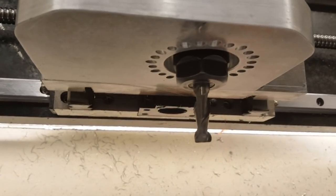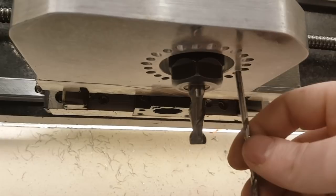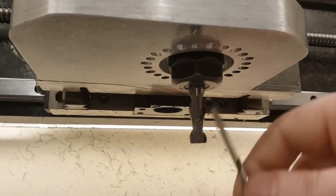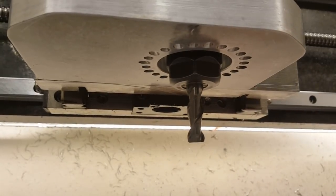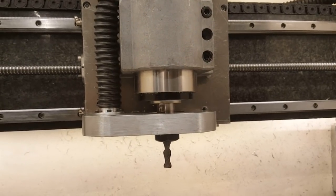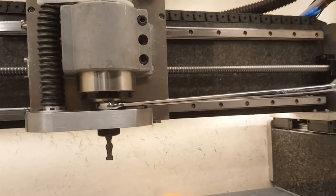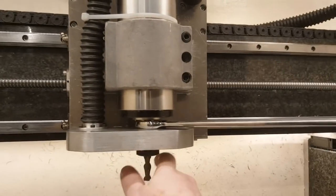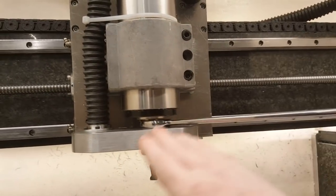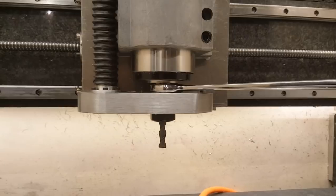Another reason for the new design was to have the walls of the nozzles very smooth so the stream isn't as broken as from the printed one. Also, when you try to undo the collet and use a wrench, you can place it there and leave it, then just use the other wrench on the bottom — you don't need to hold the top one because it holds itself. I found that very handy. I'll show you how it works.